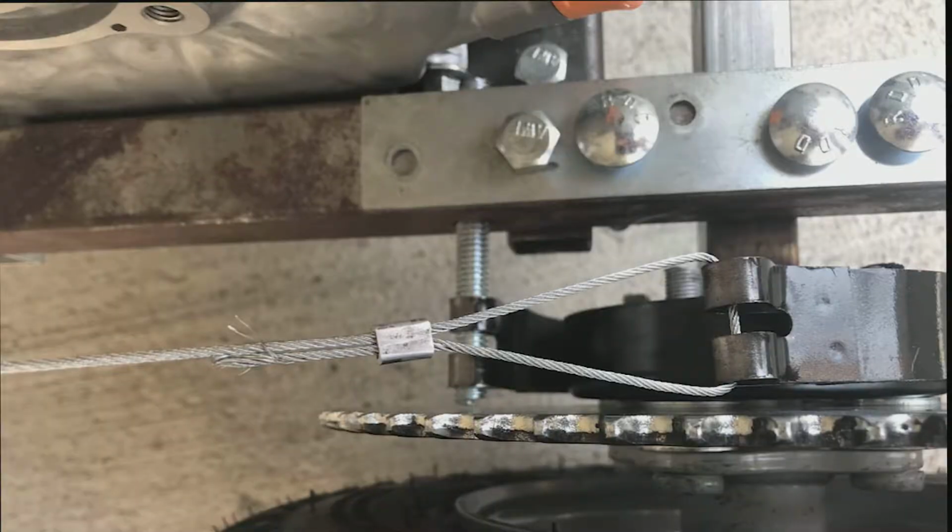We also set up the brake system with a brake collar around the rear drive wheel, which would constrict on the wheel when we pressed on the brake pedal. The pedal was attached to the brake line that ran under the cart to the collar around the drive wheel. That way, when we pushed on the pedal, enough tension would be generated to tighten the brake collar and slow the car down.